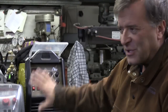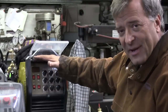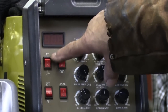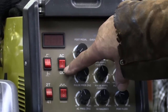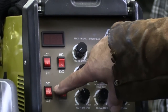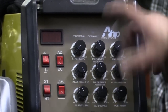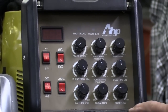It's real easy on the machine as far as setup goes. Starting up here at the top, your TIG/stick switch — just go ahead and flip it up to stick. AC or DC, depending on what type of stick you're running. 2T, pulse off, and then we'll adjust the amperage and what have you as soon as we fire the machine up.